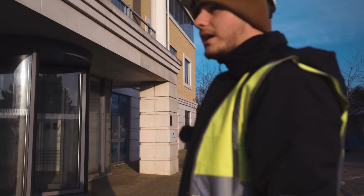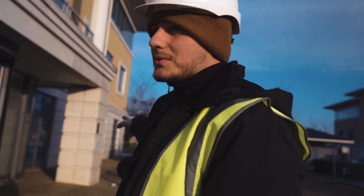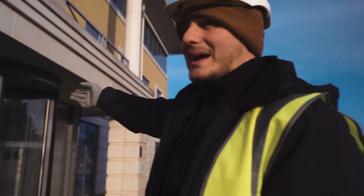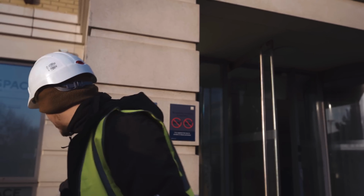Hello mate, you alright? Yeah, good. Got a result, 2 cables. Yeah. Got a result, 2 cables. No result, 1 cable. You'd think that's end of line though, wouldn't you? Right. But I've tested between neutral and earth, and there's no continuity there, which if it was connected at the mains... What we do have, I've just noticed that as well.